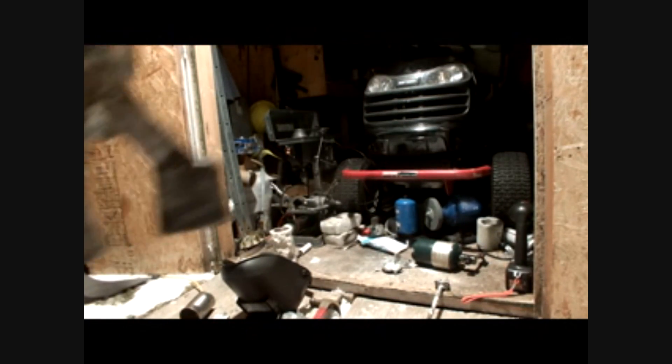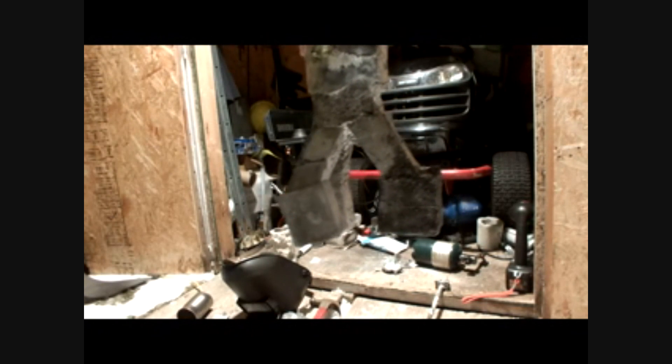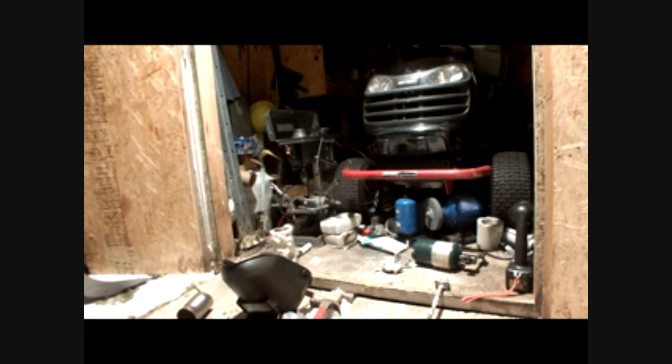The way I got it off was about five minutes after I poured it. I let it cool enough until it stopped glowing and then a little bit after that I just dunked it in water. That cooled it enough and it also shocked all the plaster off. What proves I'm doing this right is if you hit it, it resonates — that means it has a good crystal structure. The aluminum is nice and clean, there's no air bubbles or anything.